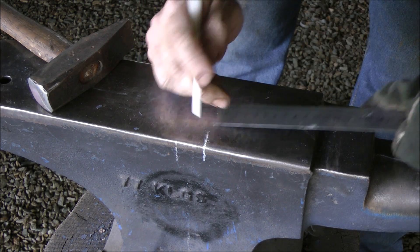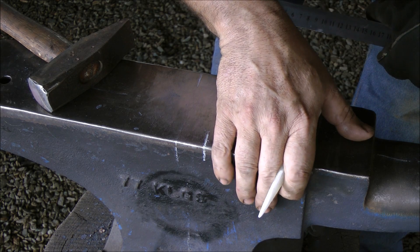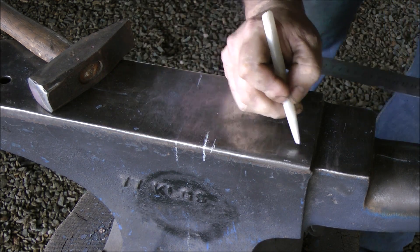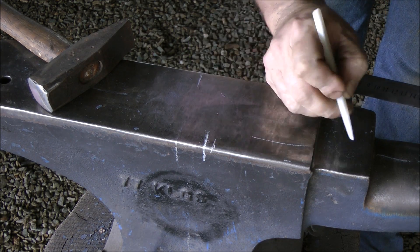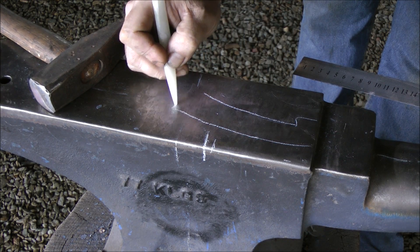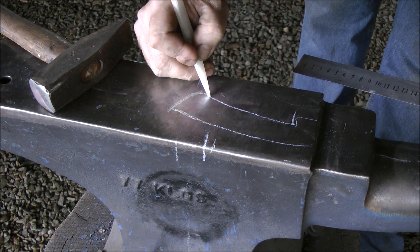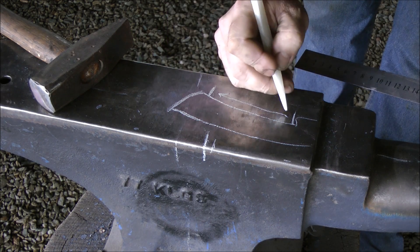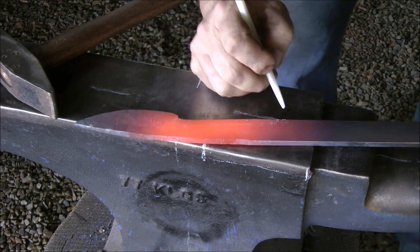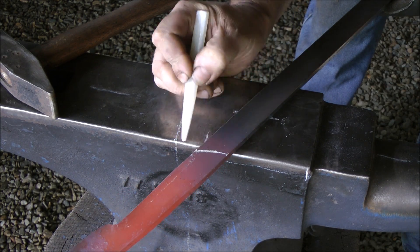That is measured on the inside, so the finger side of your knife. In millimeters, you've got about 10mm space on this side. And if I have to draw out the tang — the blade side is on the side — I'm going to do a bit of a curve and tail it out. So from here to there I do 100 millimeters, and 100 more is going to put it about there. So now I'm just drawing up what I want to have happen here.